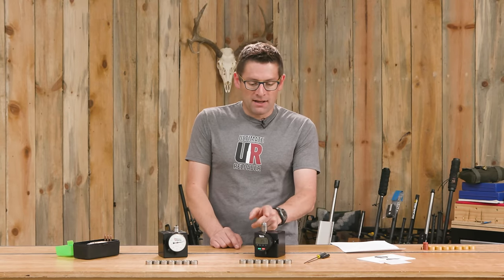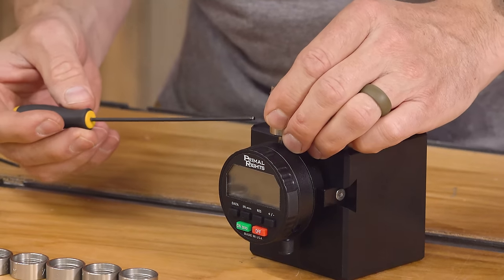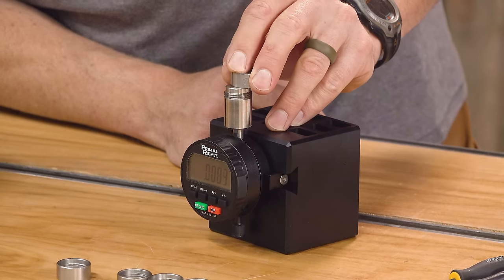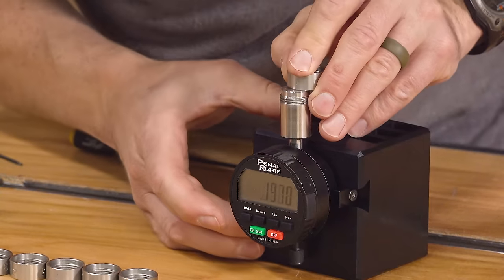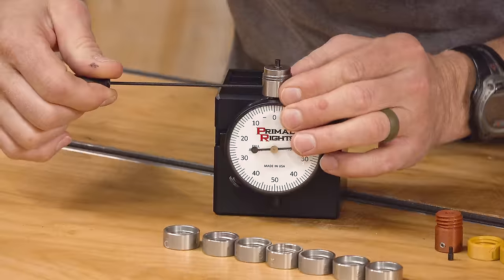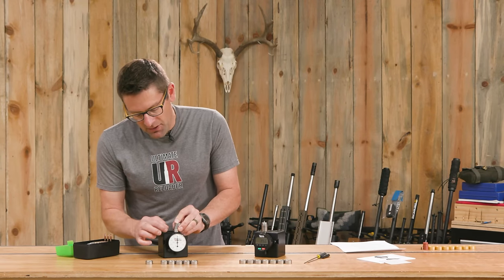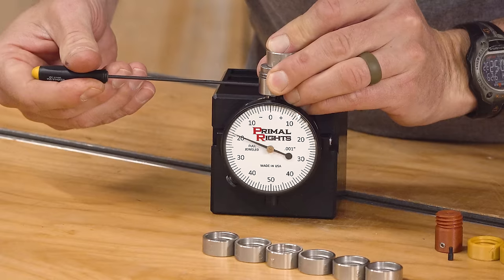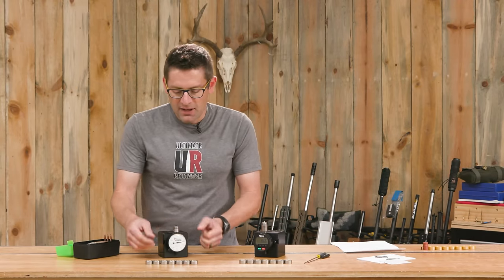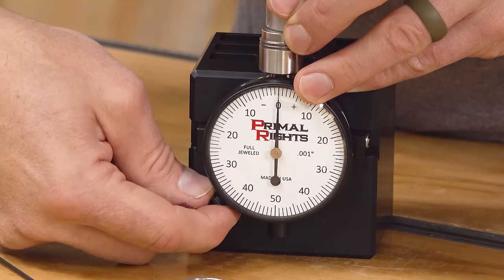We then move on to getting the body installed at the proper height on the dial indicator. These are 3/8ths bodies. On the digital unit it's really easy: take one of your collars, push down on the needle to get it flush with the top of the body, and hit the green button to zero the indicator. On the analog indicator it's a little more complicated but not difficult. While pushing down on the body, hold one of the collars and loosen or tighten the set screw until the needle is pointing almost vertical — every complete revolution of the needle is 100 thousandths of an inch. Then tighten it down and rotate the dial to zero it, just like you would on a mill or lathe.